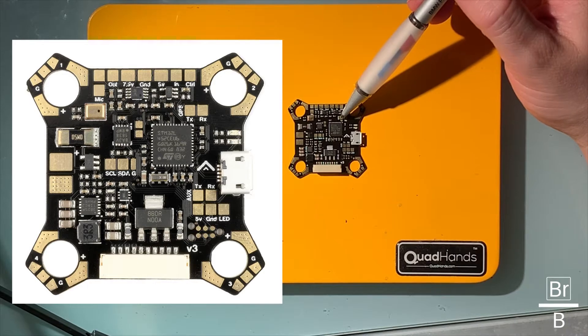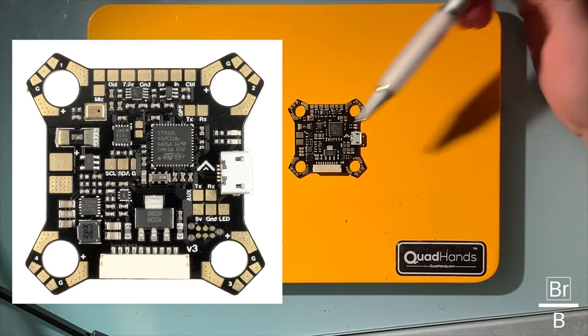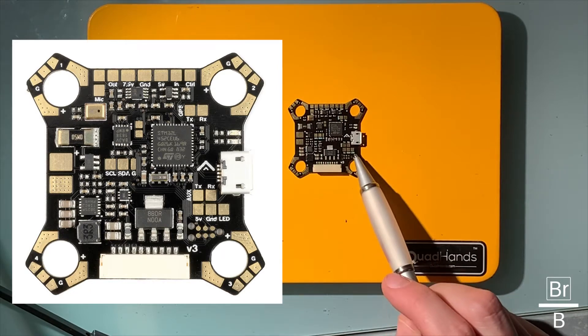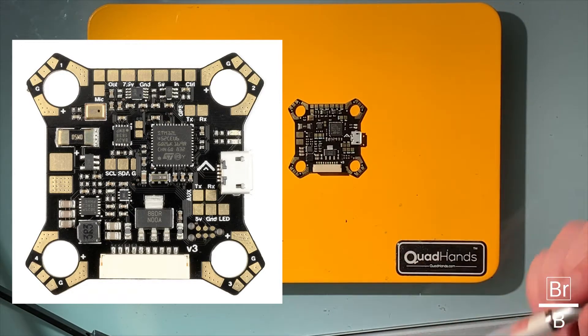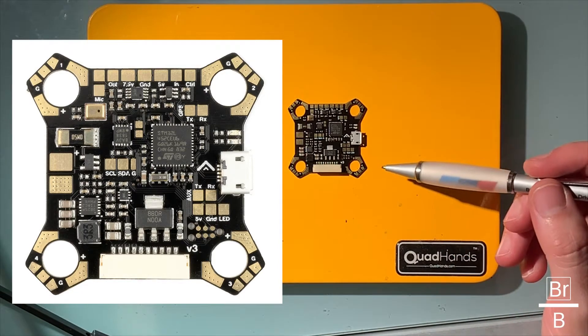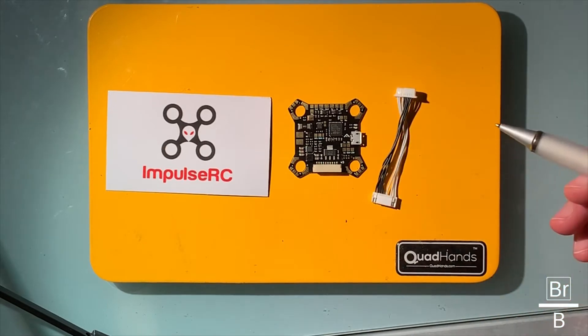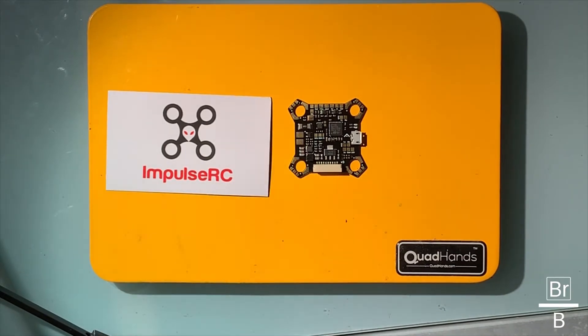You've got GPS — TX and RX — which is great. There's also SCL, SDA, and a ground pad for that. Behind the USB port you've got an auxiliary TX/RX. You've got 5-volt ground and LED control — addressable LEDs are an option, and KISS supports that too. You can actually set it up on one of the potentiometers at the top of your radio to control your LEDs. And at the back, as I mentioned, you've got your harness, which is a super clean and simple way to connect any of the KISS flight controller systems.